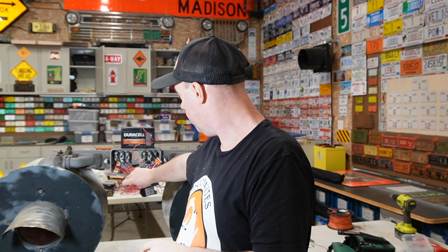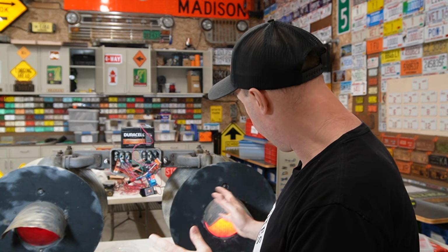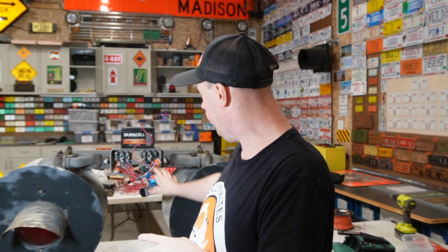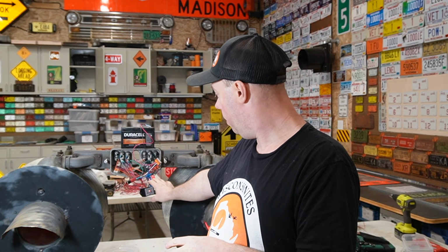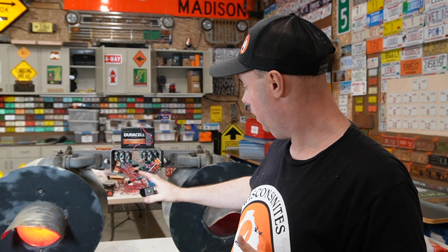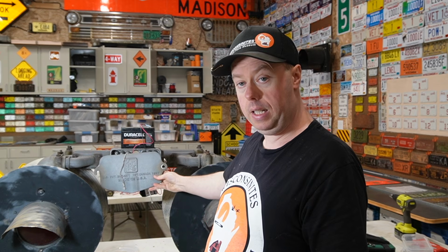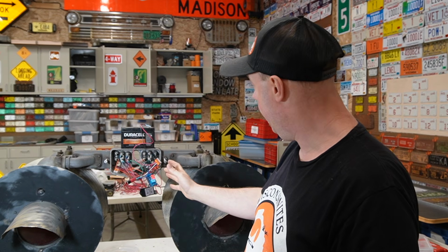Our test benches are done. We've proven that these work, that we can just do what we need to do, activate the bell, activate the flashing. I do have to get these things cleaned up, and I'll get this actually onto that fuse box, and then all this bunned up to make it look nice and neat. The mounting hardware in, and that way we can get this on the pole.